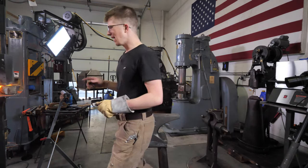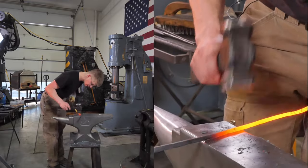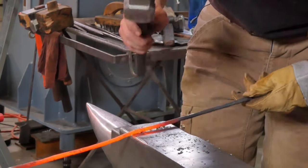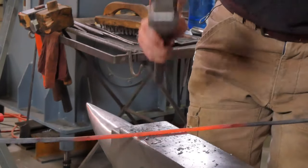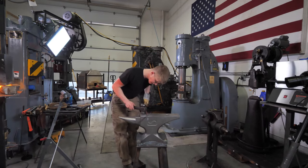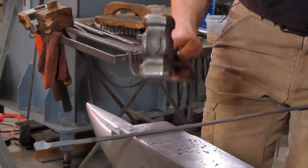This refractory is from, oh boy, High Temp Tools, H-I-G-H Temp Tools dot com. They're based here in the US. They sell the refractory that we use, listed as medium density castable, I believe. And the Kaowool underneath that refractory is just their 1-inch 2700 degree or 2800 degree Kaowool, maybe. I think it's their 2800 degree Kaowool, I don't know. You should be able to get away with 2600 degree Kaowool, provided you've got a thick enough layer of that medium density refractory.